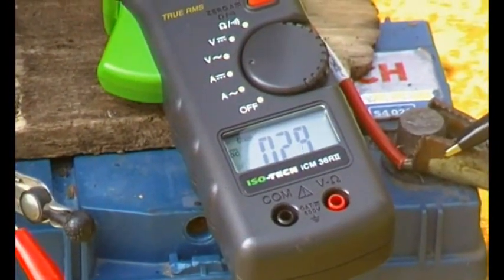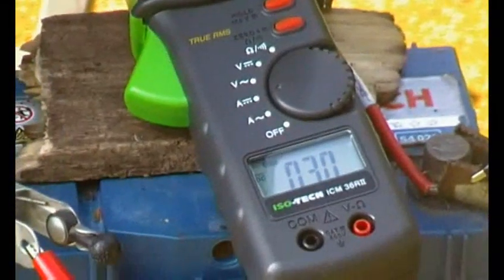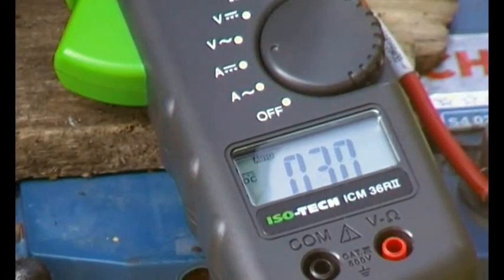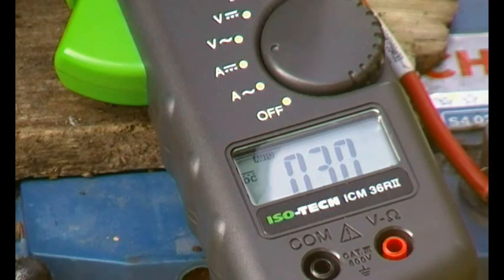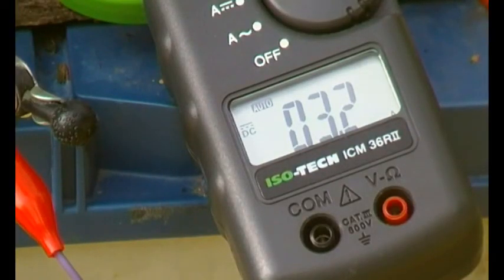As you can see, we've got good strong sun and it's 2.8 amps on the clamp meter. To increase the load, I've put this headlight bulb there, so we're drawing power out of the battery and out of the panel. That's a headlight bulb which we will use later. We're getting quite strong sun now — 2.8 amps. Let's just wait for this very light cloud to disappear. Right, we've got very strong sun now and we're getting 3.2 amps, with quite a load across this panel. 3.3 amps — call it maximum.